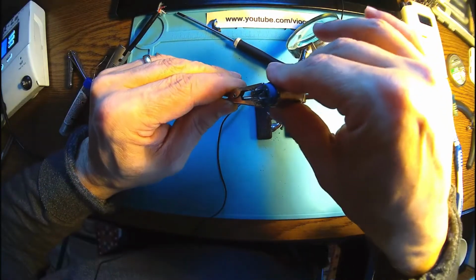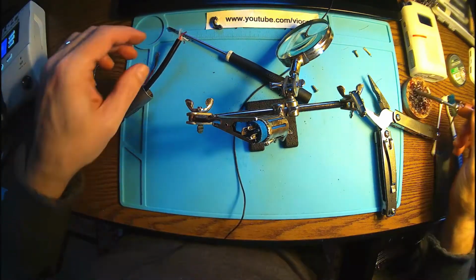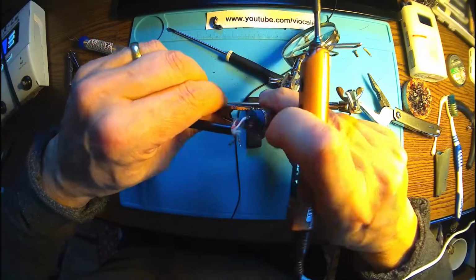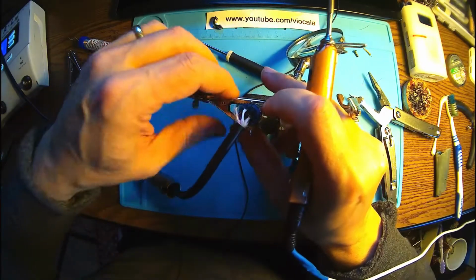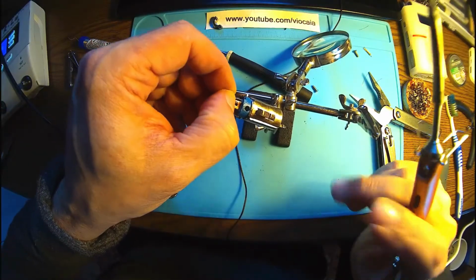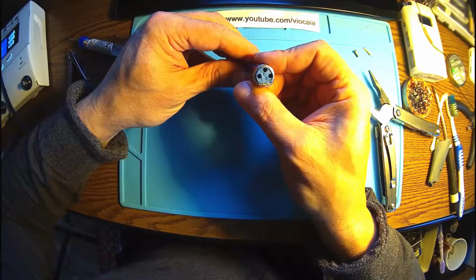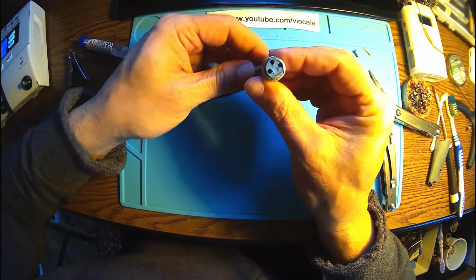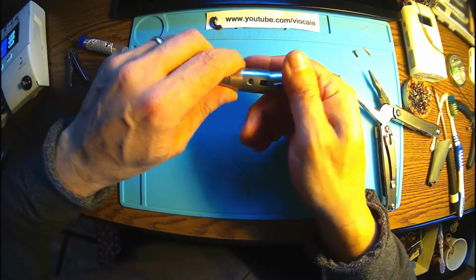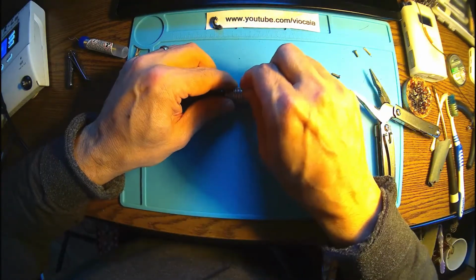Let's put the wires back together. We have the red one on number 2. That's the hot. Number 2. It's not exactly ground, but let's call it minus, number 3 here. That's the ground. And of course, the last one, very important too, it's the case ground. Perfect. Yeah, everything is back in place. So number 2, it's hot. Number 3, it's minus, let's call it, or cold. And number 1, let's have the screws back.